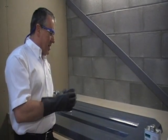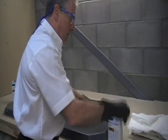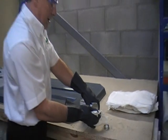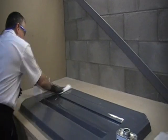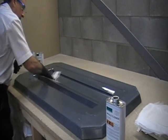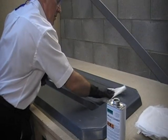When you've got the mould to the standard that you want it, ready for moulding, what you need to do is clean off with the mould cleaner. The mould cleaner is very easy to use. You take one of our special cloths which has no lint, wet it up well and apply a good wet film all over the mould. If it's a bigger mould you'd be wanting to work on areas about half a square metre at a time.